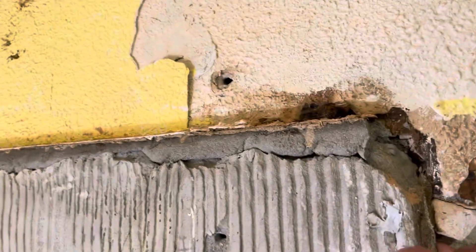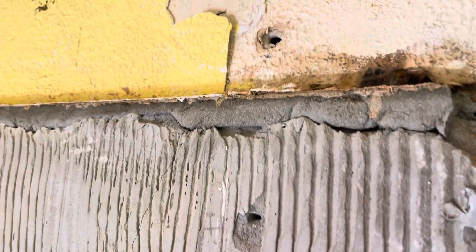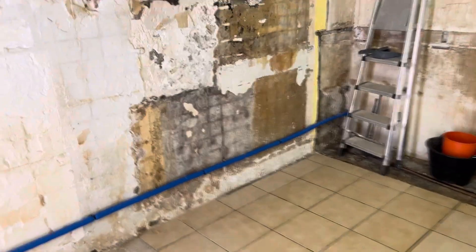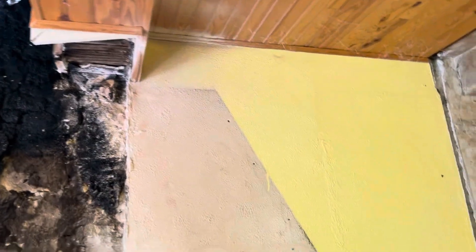We don't know whether to take this off or whether to put plasterboard here to the roof and do the same there. What we're going to do is put a two-inch batten along that wall, roughly eight feet from the ceiling. Then we can dot and dab — set the sheets of plasterboard on the one-inch batten, two-by-one, and stand them up against the walls, squiggle them, get them juggled into place. That will save a lot of plastering.